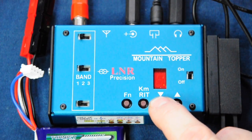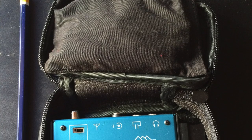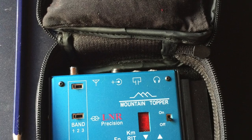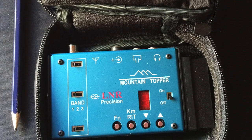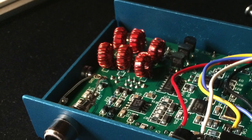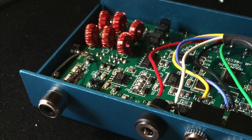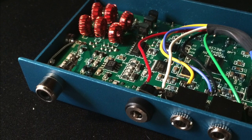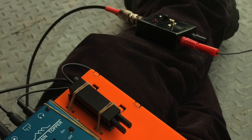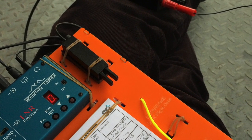To wrap up — fantastic little rig, I absolutely love it, it is genius. Receive current is about 36 milliamps, and on transmit about 400 milliamps to give about 2.5 to 3 watts output with a 12 volt supply. So it works really well on a tiny LiPo battery. It's obviously pretty well adapted for portable applications where weight and size are really important, and where you typically find a free frequency and call rather than tuning around. Many people use the MTR with an external speaker but I've found it absolutely fine with simple headphones.